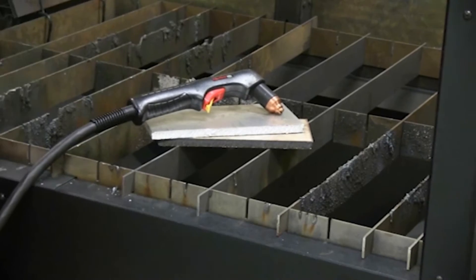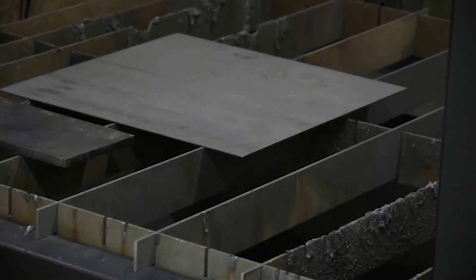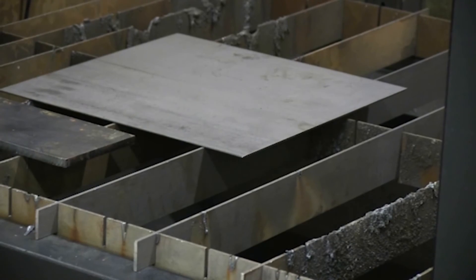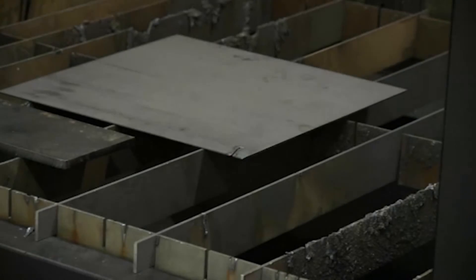These are also some cuts I did earlier on stainless steel and aluminum. If the cuts need to be started off the edge, then the metal needs to be pierced first. If cutting thinner material, quarter inch or less, I simply place the torch on the metal and start the plasma arc.